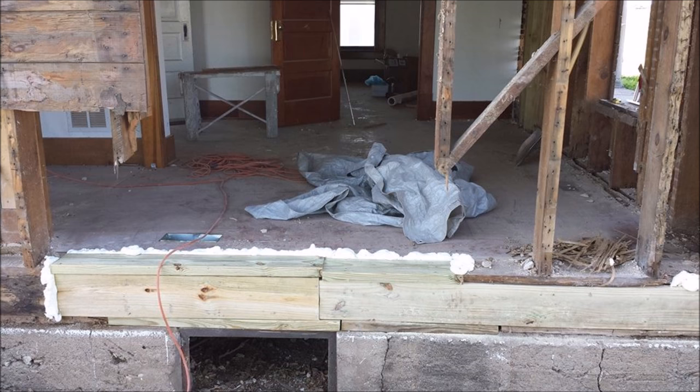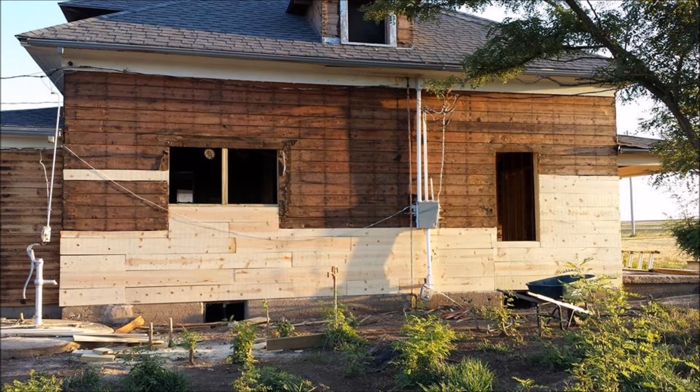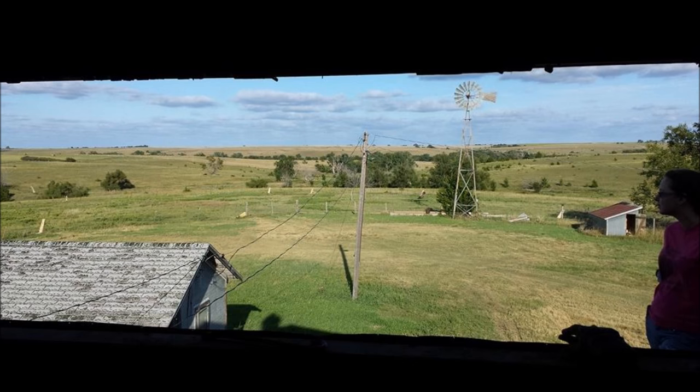It's pretty self-explanatory — I just replaced it all. Make sure you use green plate especially for the sill plate at the bottom. I foamed everything up because I'm always worried about critters getting in. The framing is standard 2x6 walls — just make sure you do it correctly. This is it when it's totally sheathed. I could have used plywood, but the original wood was a unique thickness, so I matched it with plank wood to avoid differences when I went to side it.